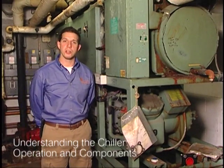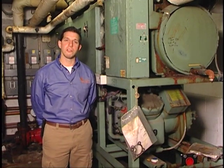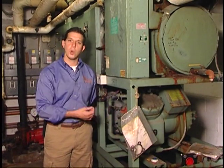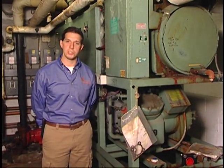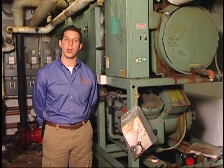Before testing our chiller, it's important to understand the total system and its components. First, we'd like to identify the nameplate to understand what type of chiller we're looking at. We'd look at the evaporator and understand how heat is being absorbed, then move to the compressors — what type are installed and how are they utilized and controlled? Then we'd look at the condensers and how the heat is rejected. Once we understand where all the pressure gauges, temperature gauges, and control elements are, we'll be able to begin our test.